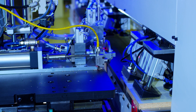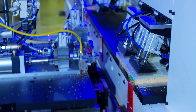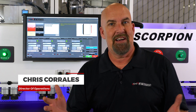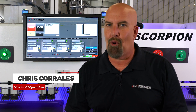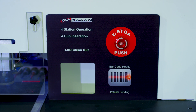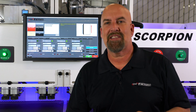The power of 5th generation allows the Scorpion LDR to perform dual drilling. Other machines can do that, but it's usually just one at a time — with 5th generation, we can do dual drilling. The Scorpion LDR will also automatically change its bit size. For example, if you are processing MDF, you need to use an 8.2mm — in the past, you would have to stop the machine and manually swap bits. The Scorpion LDR does that automatically, and of course it has 5mm on board as well, automatically changing itself with no user intervention. Production runs include self-clean-outs — it will know if it needs to be cleaned out and will clean itself — plus automatic reloads. That's the power of 5th generation. Now let's go to the screen.